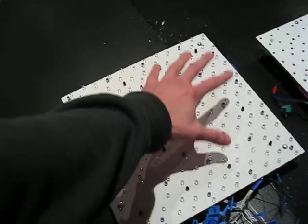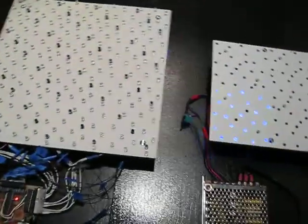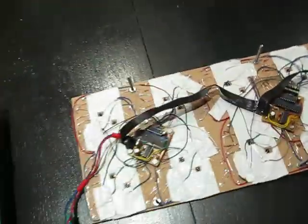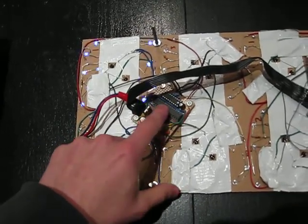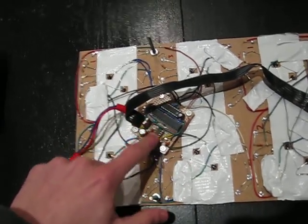See, this one stopped working with the lights on. This one still works. Starting with the old one — if you've seen the previous video this would be old news — it has an ATmega48 or ATmega168. One of those controllers is this chip here, and there's a Darlington transistor array and a quad op-amp.